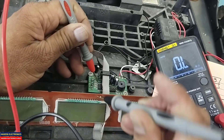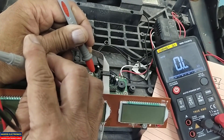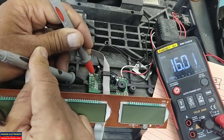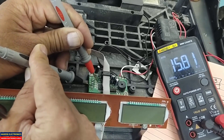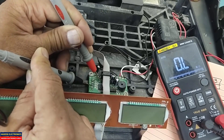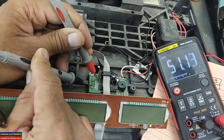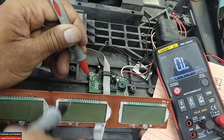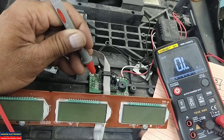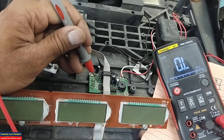On the last pin, I see 51 ohms between the outermost pin and the input. Moving to the second input terminal, it must be open — it reads 15 megaohms. Moving to the second pin, the analog input pin, it reads 51 ohms. So both input pins have 51-ohm resistance — these are current-limiting resistors for protection.